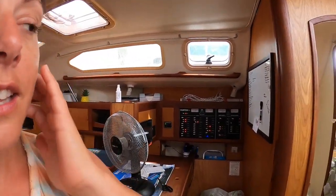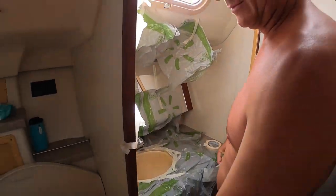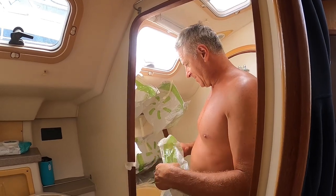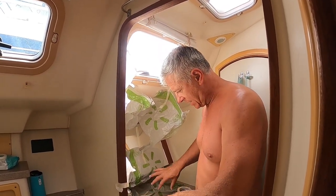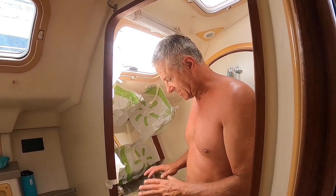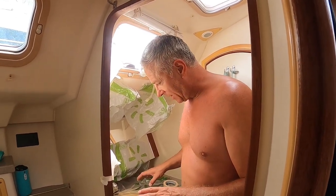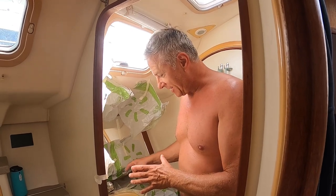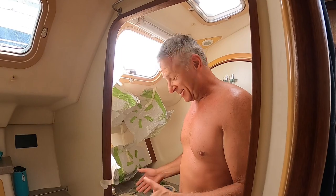Originally, we were just going to change the elbow and put in a new drain. And now it's turned into a paint booth. Bathmaster's refinishing. A long time ago, somebody dumped some adhesives or something down in here, and it's stained the sink. I've tried to scrub it out, tried to polish it out, tried to sand it out. It's not happening. So I said, well, if we're putting a new drain in, why don't we do the Bathmaster's refinish? I roughed up the whole surface, cleaned it with acetone, and now I am going to paint the sink. Because finding an oval undermount sink that will fit this is going to be impossible without ordering one right from Hunter, which we may down the road do. But for now, I'm just going to hit it with some plastic coat, see if it lasts for a while, and it'll look better.